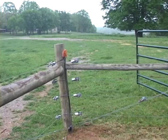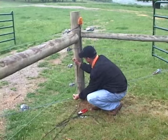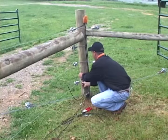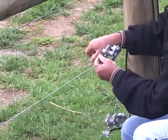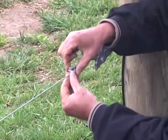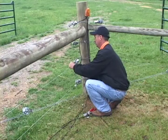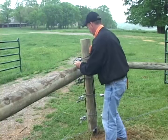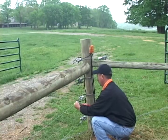Run the ground wire to the energizer location, measure the wire, and cut off the excess. Loosen the green knob, place the end in the slot, and tighten the knob. Fasten the wire as needed to prevent it from being pulled out of the energizer. Now roughly estimate the amount of double insulated cable needed to connect all of the strands of fence. Remove an inch-long segment of insulation from one end of the cable. Using a joint clamp, attach the cable to the bottom fence wire near the insulator. Arrange the cable so that it runs up the post to the next wire and attach it with a joint clamp. Continue cutting additional segments of insulated cable to connect the remaining fence conductors with joint clamps, making sure all clamps are tight. Repeat the process of connecting your circuit at the other end of the fence to complete the circuit.